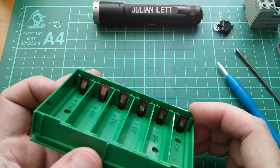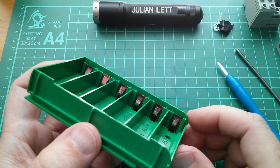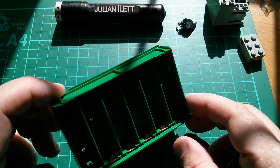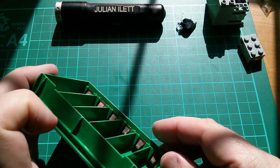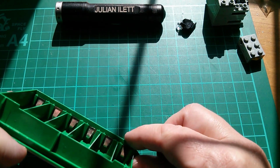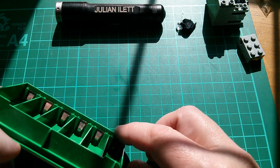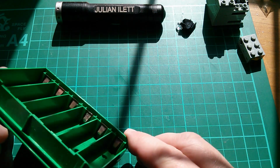Then you have to wash it, so I've washed it in water under the tap. Of course, I'm going to have to dry it now. As luck would have it, the sun's come out, so it's sunning on here and possibly drying this out a bit. So yes, I've managed to remove most of the alkali corrosion with the acid and then washed it. Of course, acid probably doesn't do these contacts any good either, but I have scraped them with the file. They do appear to be copper under something, but that something's long since been corroded away.